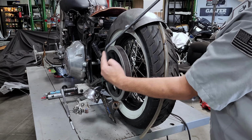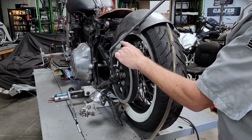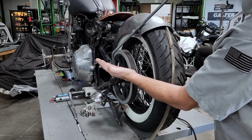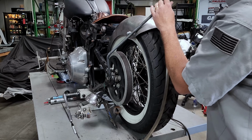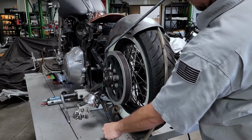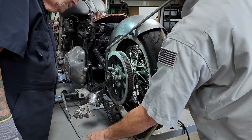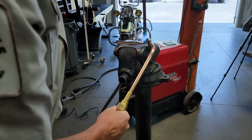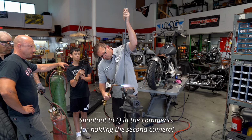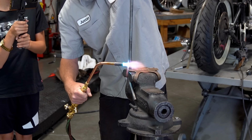So at this point, I can see that it's kind of kicking out that way. If it's overbent, then I know that when I put my other bend somewhere in this area here, that angle outward, when I straighten it up, would be the angle upward here. It's hard to explain, but we're going to go probably about here. A little more heat. And on this one, I want to match the angle of that one down there. But this one's going to have to be really tight.